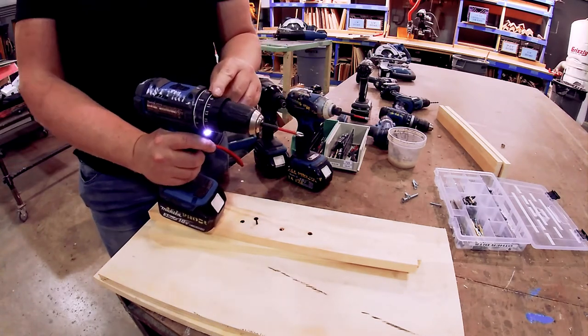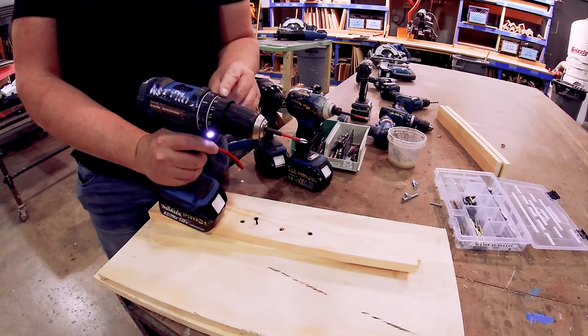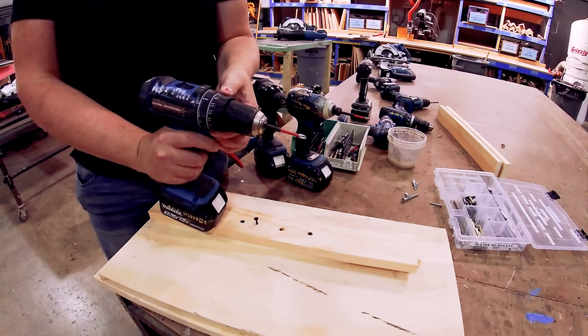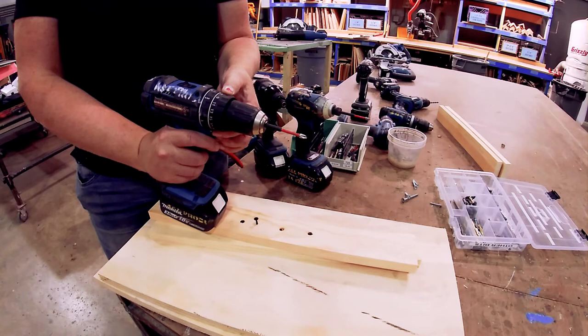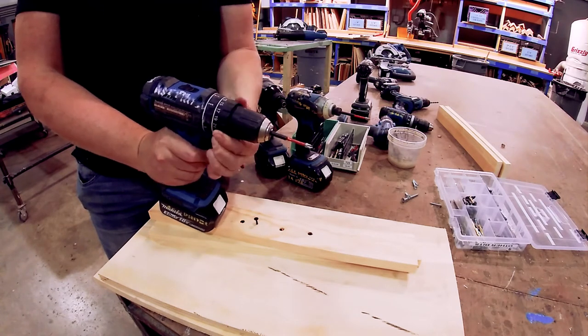The torque is there if you're going into sensitive materials, thin sheet metal or plastics that you don't want to strip out, and you want to tighten the screw down, and you'll get it to a certain point and then it'll stop. It's more likely that you're going to be doing this in the audio area than in most other areas, because they're the ones going into audio racks and other pieces of equipment where you don't want to tear out the threads built into the equipment. You've got to know that is there.